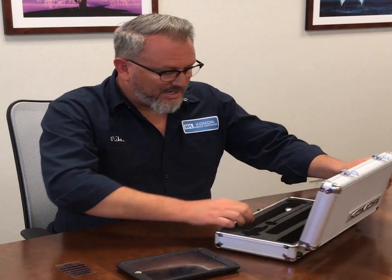So what we have in our little Komori attaché case are the two DigiNip stripe gauges. They are Bluetooth, so there's no wire, which is nice. Extremely accurate and extremely fast. How it works is you have two little stripes — a white stripe on the two ends and a red stripe in the middle. We're going to inch that in between the two rollers, get as close to the red one as possible. It takes the reading and then sends the information to your iPad, smartphone, tablet — anything you can download an app on, it will work. You put it in once, set the stripe, you're done. Basically set it and forget it. It's very simple.